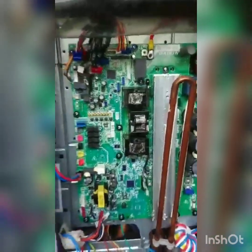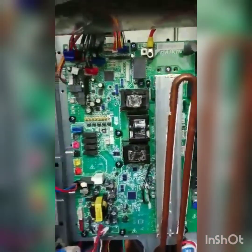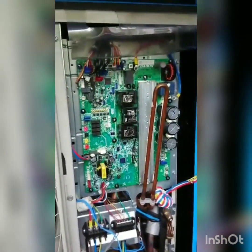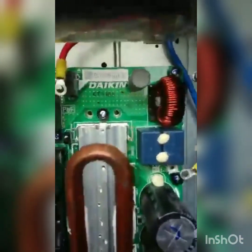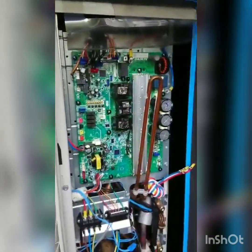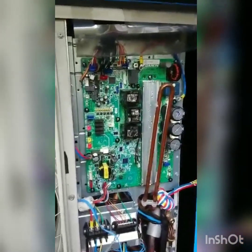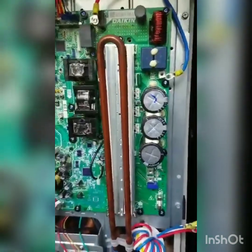The new board is now in position, simply screwed back in - doing exactly the reverse of the way it was taken out. Top tip when changing a PCB: always double-check that it's the same as the one that's come out. Don't worry too much about the numbers because those may differ, as a lot of Daikin boards are generic and are fitted into multiple systems. Do a physical check on components and plugs on the PCB to make sure everything's going to go back the way it came out.